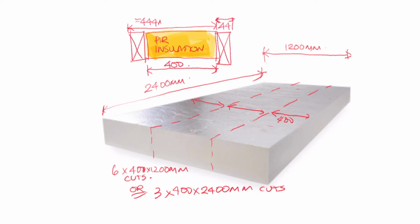Now to cut the joists. Measure your joist length and, really important, add 2 to 3mm to it, and that way you can friction fit it accurately by tapping it into place with your hammer. And this flexible nature of timber is what makes it such a pleasure to work with in construction. I love working with timber and I love working with timber frame, and I hope you will too.